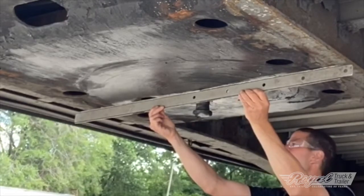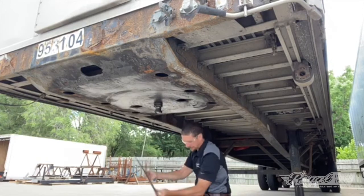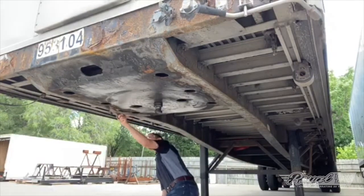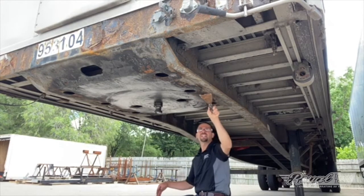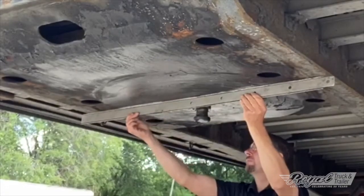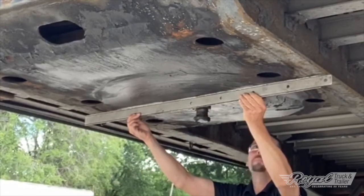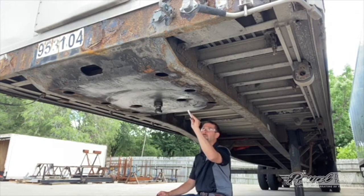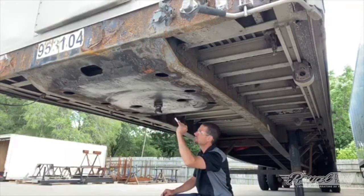Checking for square — not liking that very much; you can see a gap on one side. Four and a half inches shows it's perfectly flat on that section. What we have is some rust and corrosion on this side causing the plate to stick up a little bit on both sides. After cleaning, it's much better, but you can see especially right where the fifth wheel rides there is a small air gap — not necessarily something to be alarmed about though. Make sure there are no cracks; the worst area for cracks would be from drain hole to drain hole. Very good for its age.